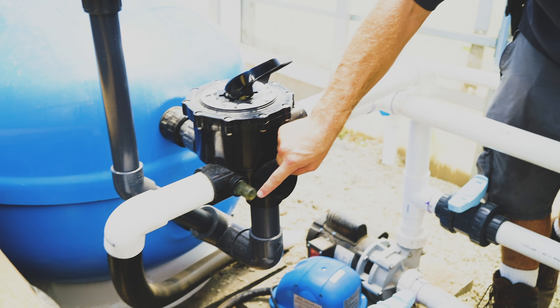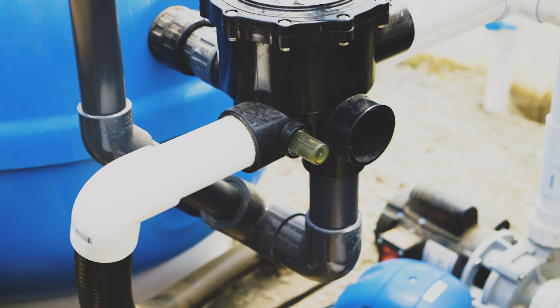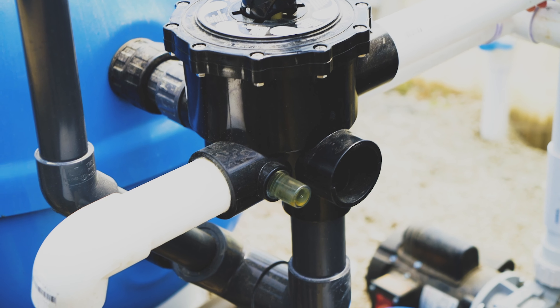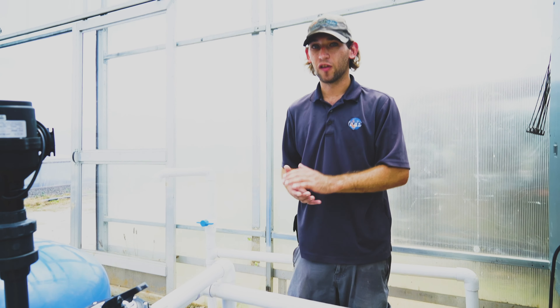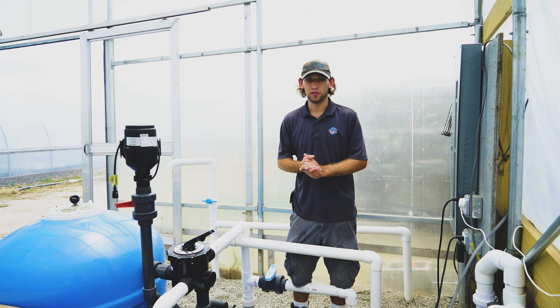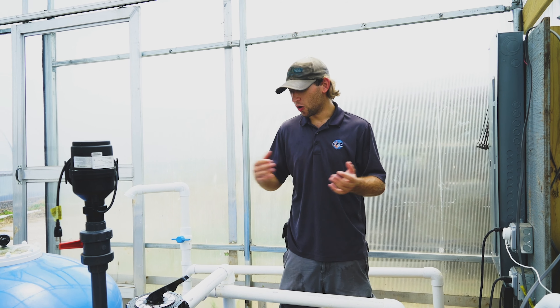This is going to start running clean, and then eventually it's going to turn dirty — it may even turn to a sort of puke green color. Depending on what setup you have in your pond, your stocking density, and the frequency of backwashing your filter, typically you can backwash your filter once a week. I backwash these once a day because they're a big fish load. Our water coming through the sight glass isn't going to appear as dirty, but if you're doing yours once a week, it's going to look pretty nasty. Because I backwash these once a day, it only needs to run on backwash for about one to two minutes at most, but if you're backwashing every week, it may be a longer cycle.